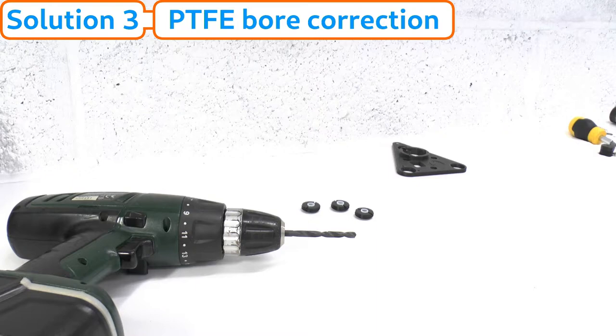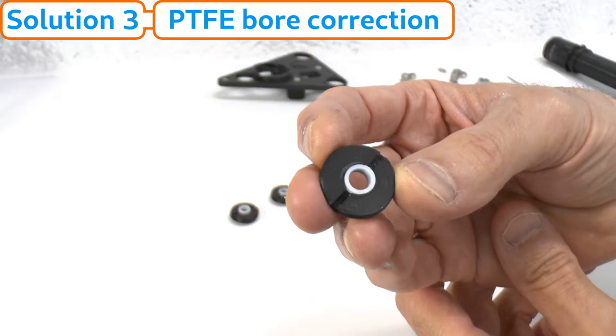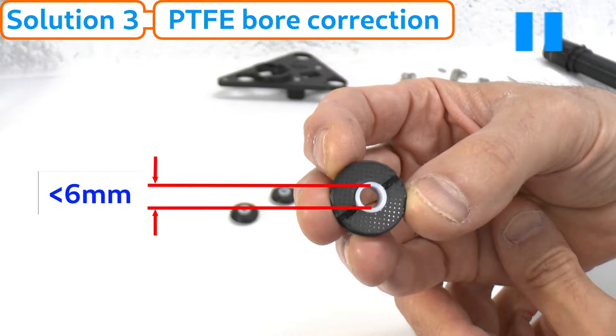The procedure may be required because in some cases the 3D printed hole in the adjustable articulations needs to be a tight fit to stop the PTFE ferule sliding out during use. But this means the printing tolerances are low and the fit could be too tight, such that when the ferules are squeezed in they become slightly distorted, with at least parts of their diameter becoming smaller than 6mm. This causes them to hold too tightly onto the focus post bolt thread.